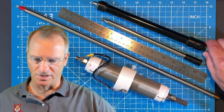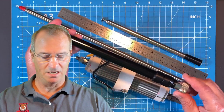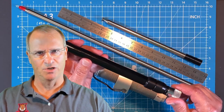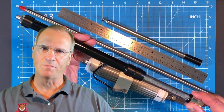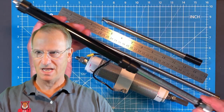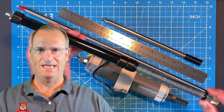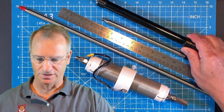Secondly, when we first introduced the Gable antenna, I read through the instructions rather quickly and I made a mistake. I first talked about this being able to radiate from 6 meters through 20, and then you had to add that secondary coil to get 40 — that is not an accurate statement. When you use the telescoping feature of this base, right about here gets you to 20 meters, and right about here gets you to 40 meters. That extra coil gets you on 80. So this is exactly a head-to-head comparison with the Wolf River coil mini, which is what we have on the table in front of us here now.